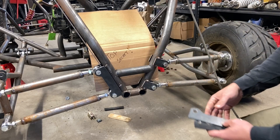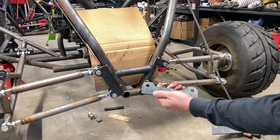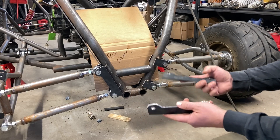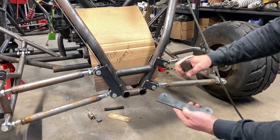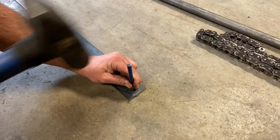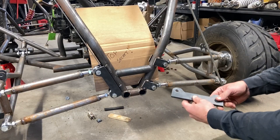I'll cut these off and put these on — too easy. A lot of you guys wonder why I don't laser-cut stuff. These only took maybe ten minutes each to make. That's less time than it takes to design one in CAD or sheet metal or whatever you're using. I draw up a simple plan, measure five-eighths in, five-eighths in, tap it, drill it, and then I come up with a cool shape. I make one as a master to replicate four pieces.